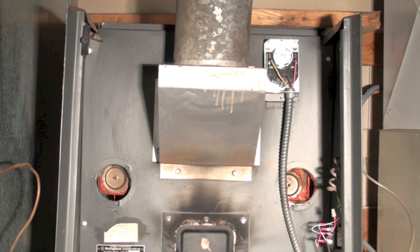You'll notice I did this on a high-boy — a low-boy is not going to work as well since most of them don't have clean-outs, although a couple do. I still recommend you use a VAC truck to do this, but if you have to, this is a way you can clean the heat exchanger on an oil furnace. Remember, one-eighth of an inch of soot is about equal to an inch of fiberglass insulation — it's a very good insulator, and you want as little of that as possible on a heat exchanger.